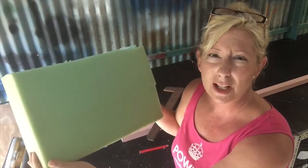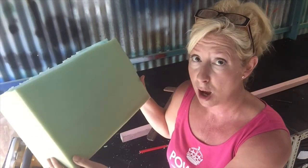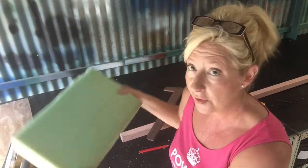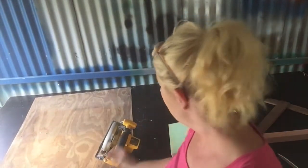There we go. Don't be concerned if it's not absolutely perfect because we are going to make a cover for it and it will hide a multitude of sins. The next thing we need to do is measure this size and cut a piece out of some board. I've got some plywood board over here. I'm going to trace around my piece of foam and cut a board the right size using a circular saw.